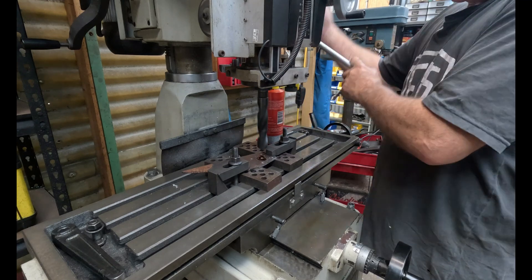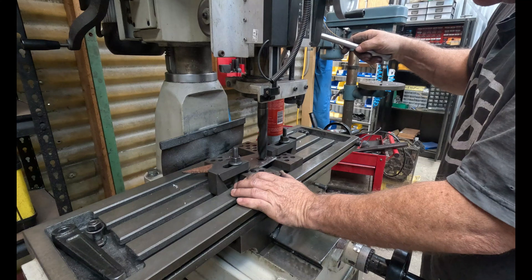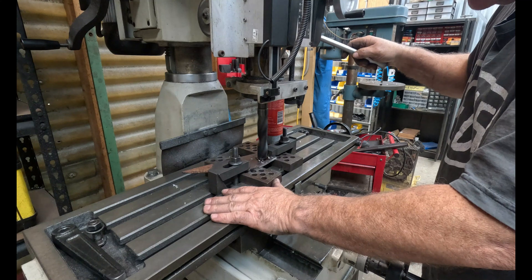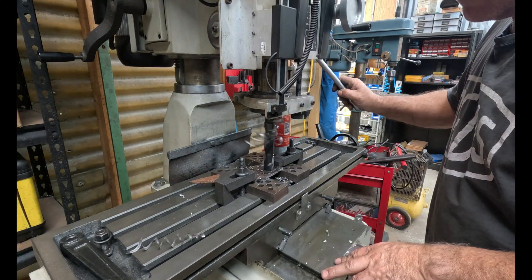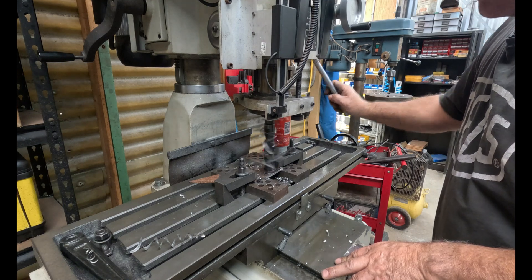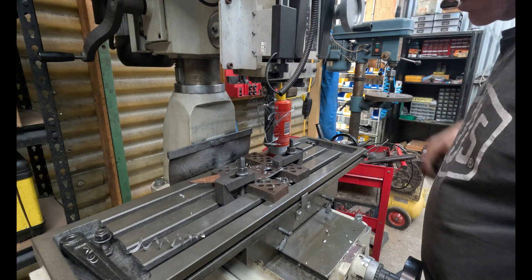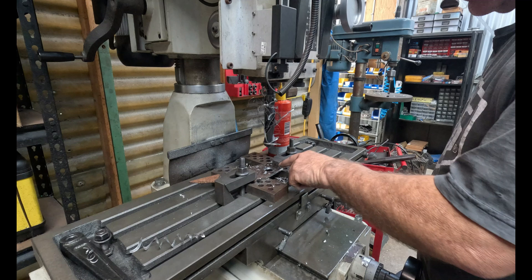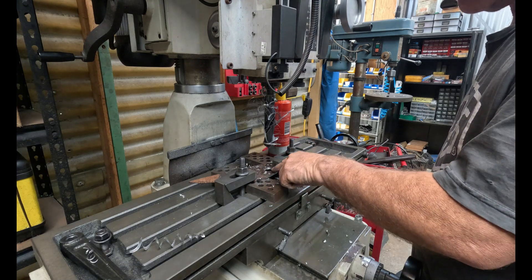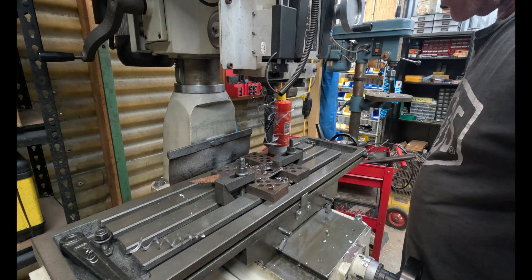I've got my smaller rivet holes drilled and I'm just doing the bigger hole in the centre now — a 25mm drill. I think that's going to give me enough clearance. This 25mm is going to give me enough clearance on the spacers I've got made up on the front wheel. But I'm just going to double check while it's in here, because I might throw the boring head in and just take a couple of mil out of it.